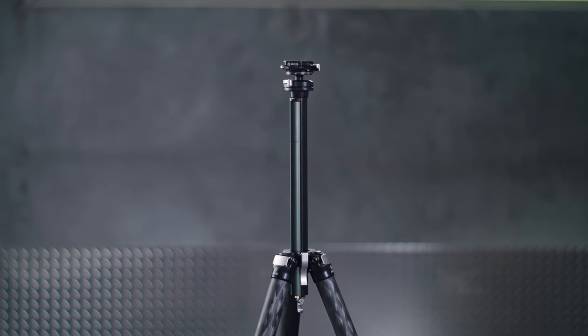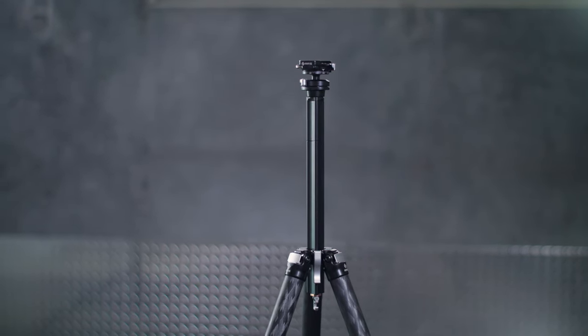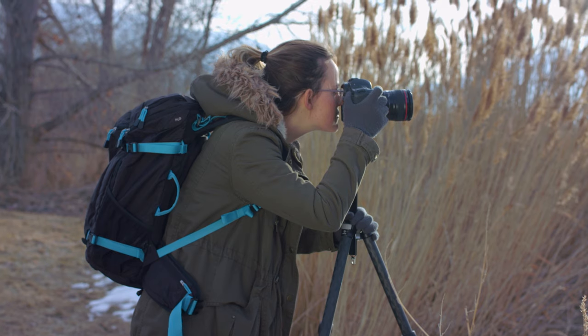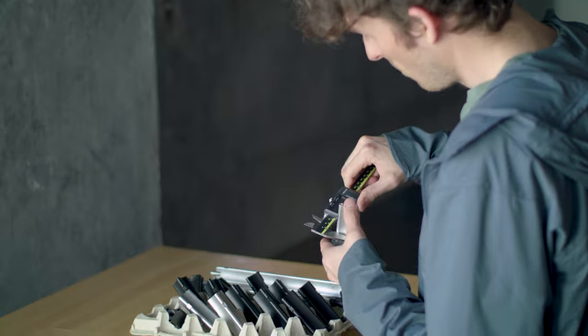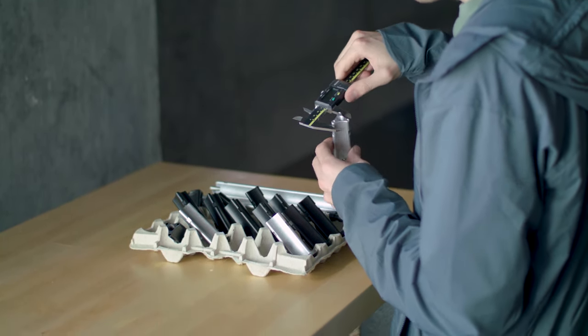In order to fix that, we had to ensure that both halves of the center column come from the same extruded stock. When you extrude aluminum, you're essentially pushing hot aluminum through a die — imagine a big piece of spaghetti being pulled out. The shape can change based on how hard you're pushing it or pulling it, as well as temperature. So we had to make sure both halves were taken from the same extrusion and not one done on a separate day, so they have the exact same dimensions and the feel between the two is very smooth.